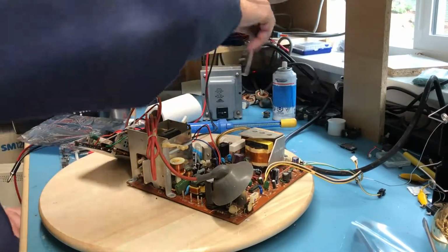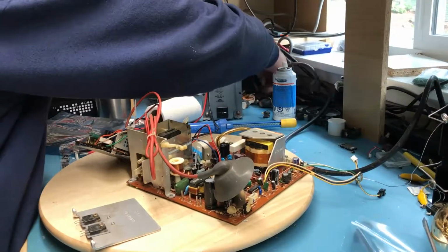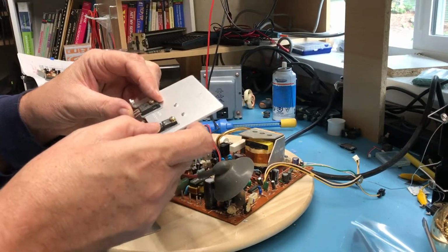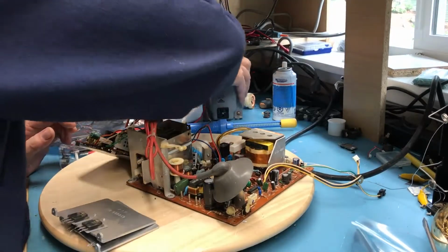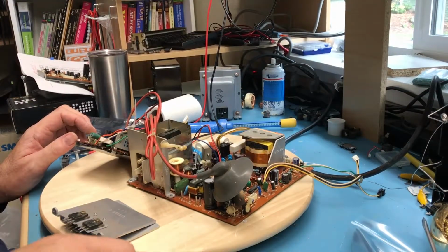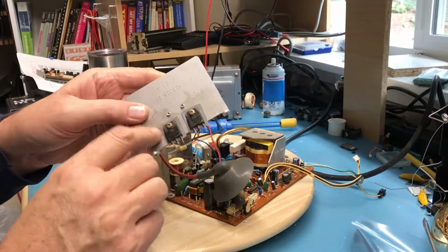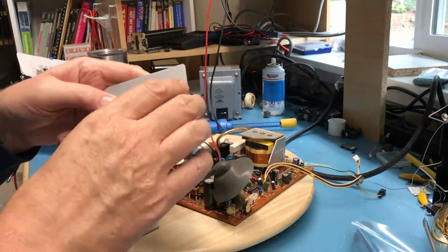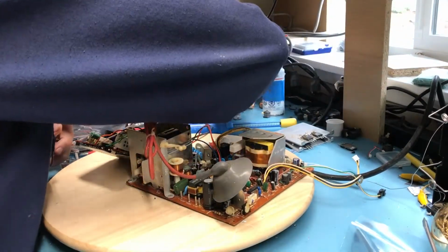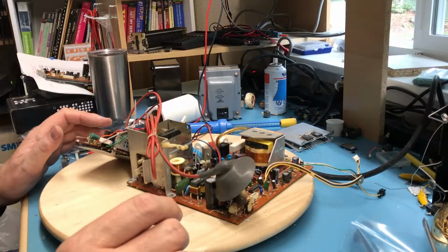I've actually got a place to start here. I've got a lot of, almost all MOSFETs that have come out of switching power supplies, but that's just a set of diodes. So I may have to go cross-reference this. Luckily, the other DigiKey order that I put together today for a different project I haven't submitted yet, so I could order a replacement for that if I had to. You know, I hold on to stuff like this. They got good sil pads underneath them. The semiconductors can be reused quite often. I think these are from that reclaimed switching power supply I did. I'll have to look through a couple other boxes to see if there's actually something that says D1398 on it.